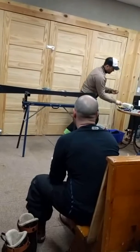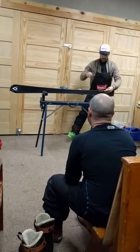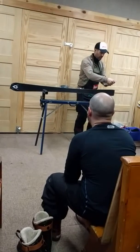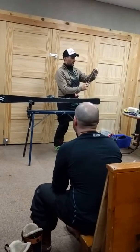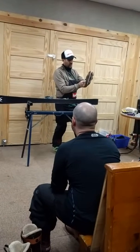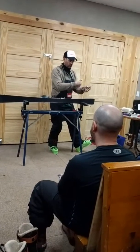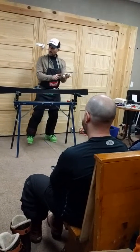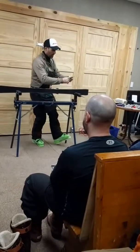So, file guide, smooth side, rough side. Smooth side goes here. And the file, there's multiple ways to put it, but there's only one way to put it. You'll see if you use your finger and you run up, the ladies who do their nails know that one side is actually, I go this way, I can slide it, this way I can't. So that's where the teeth are, so you always want the teeth, when you pull it, to sharpen. Basically, put the cutting edge down,